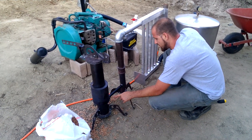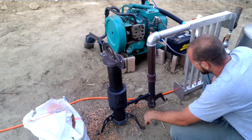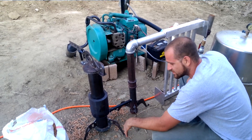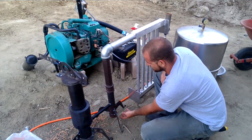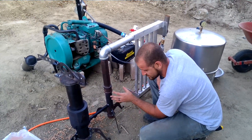We're cracking the hydrocarbons apart through high temperature zones and releasing certain fuels that are burnable inside this generation unit over here. Coming out of here is our gas outlet line, and this is just a pipe we shoved full of glass marbles. That helps us to separate tars and gives the gas something to stick to right away.